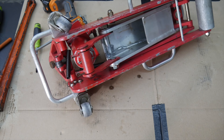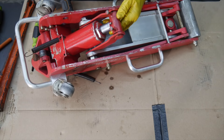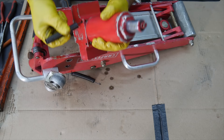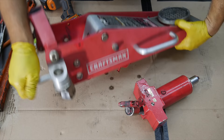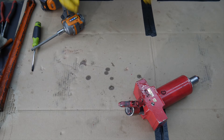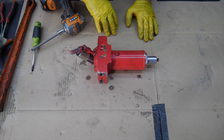Raise it up and now I can get to that cotter pin - you should be able to reuse it. I can take my cotter pin out and put that to the side, and then it basically just slides off of there. Now we can take our springs out and put them to the side as well. Now you can take your jack, clean it up if you need to - clean all the years of dust, cobwebs, and grease off of it and get it ready to put back together. You can see rather quickly we're down to the meat of taking care of our jack situation - within five minutes you can have your bottle jack sitting on your work stand.